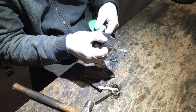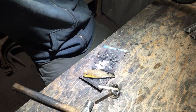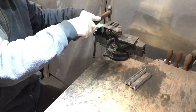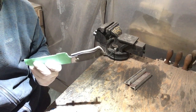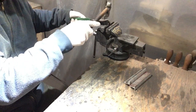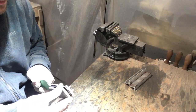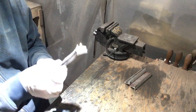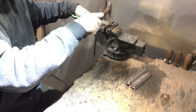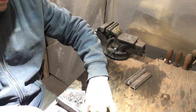That larger hole at the back is actually a lanyard tube. I'm going to hammer this just out of the frame here on the jaws of my vise. I leave the jaws a little bit open to give a little bit of room for that pin to pop through. Then it's got something for the other handle to index on. You get a little bit of protrusion, and that makes this line up nice and easy. No guessing. Okay, so I'll get this clamped up, and then we'll shape it tomorrow.